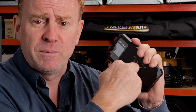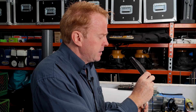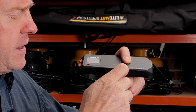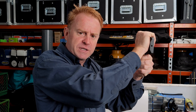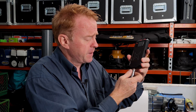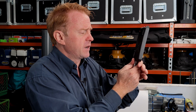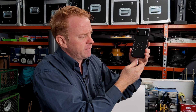The next difference between this and their previous lights — the previous small lights were very well constructed out of a very solid compound plastic. This one is made of metal, so very solid. The one thing I really like about it is the screws. You've got threads for your spigots and they're a very deep thread. No cinematographer is going to pan this and crack the housing, which is what happened on some of my other Luxly products — not a fault of design, just a fault of operator. That's not going to happen on these. It's a well-engineered, well-constructed housing.